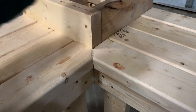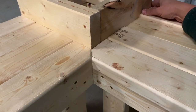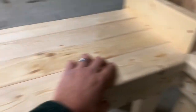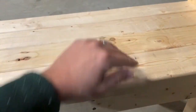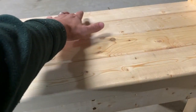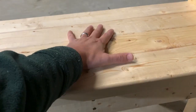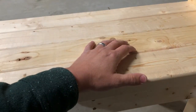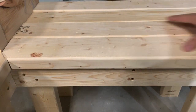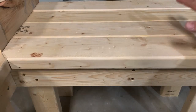So now all I got to do is put these boards together in this direction, and how to do that is very easy. What I'm going to do is flip these boards over and drill some pocket holes in three of these boards and connect all these together. And then I'll do the same thing with this board — drill some pocket holes and connect them all together. And this bench will be nearly done.